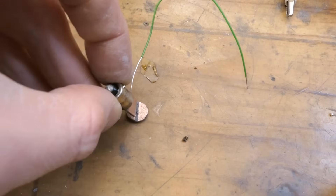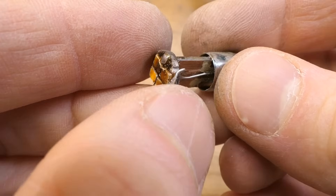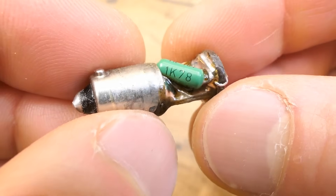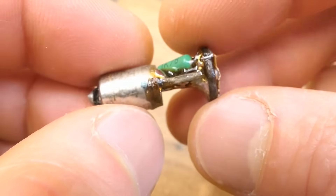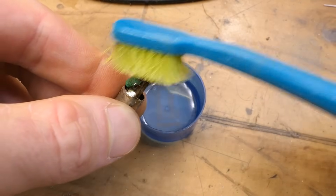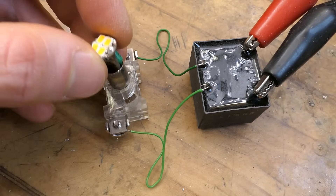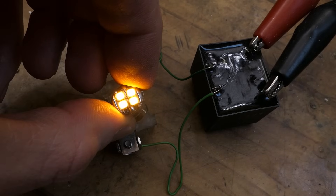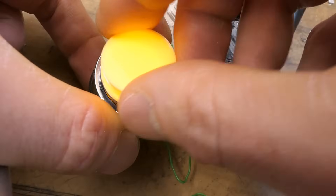Let's solder this on top of this gap. This wire continues through this notch onto the LEDs. I've put the resistor in place — 1.78 kilohms. I like weird values of resistors. Now of course a cleanup of the rosin disaster with some ethanol, and all four LEDs lighting up inside of this, which goes into the panel.